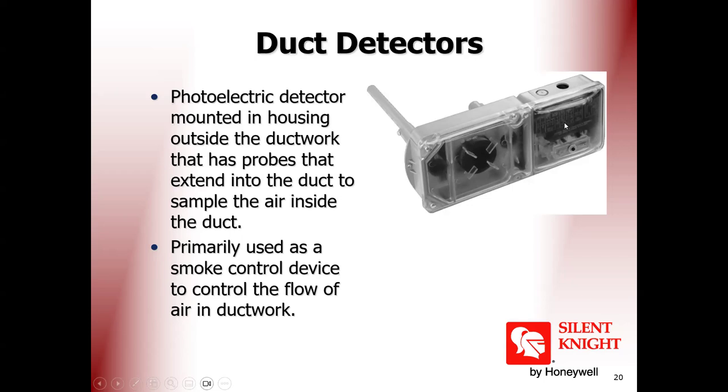Sometimes they put a relay base. What is a relay base? A smoke detector with a relay base will give the signal to the air conditioning to stop. This is an additional option, where the base has a relay dry contact to give the signal to the air condition to stop. Do you use a module or direct the detector?